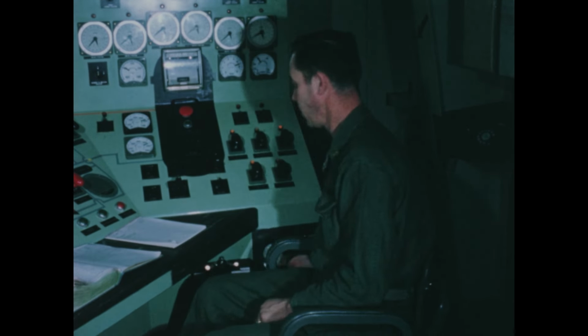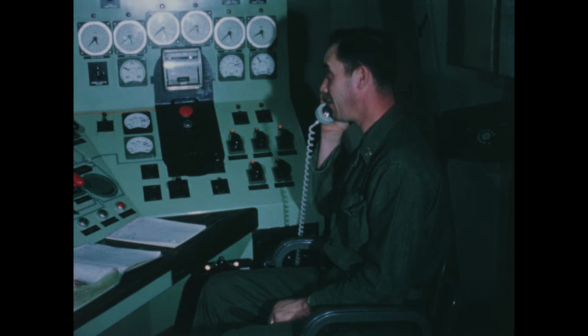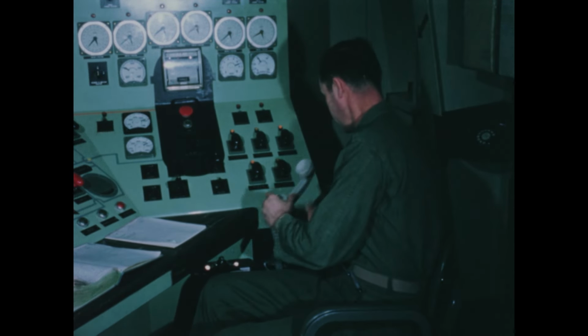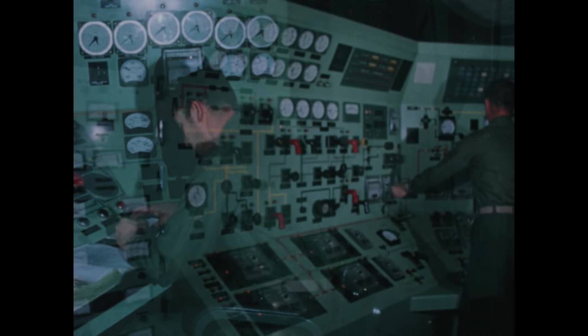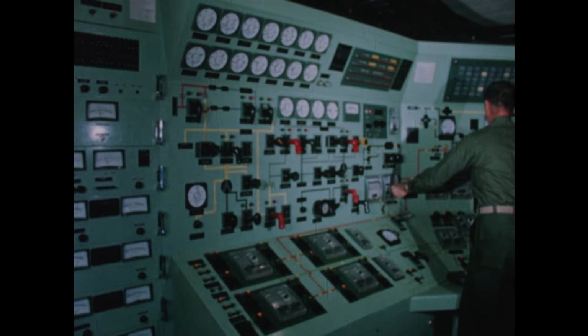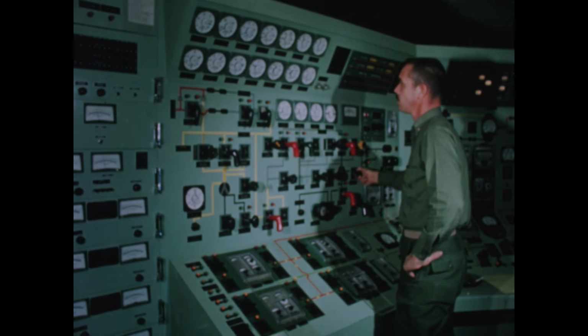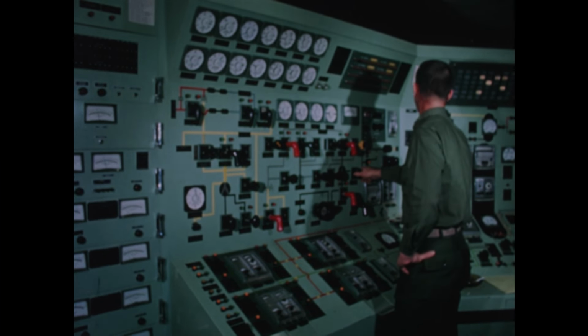After each 2,500 hours of operation, the plant is shut down for testing. When shutting down for this or for any other maintenance, inform the base electric shop so they can start base diesel generators and assume the base load. Reduce the plant load. Start the plant emergency diesel and assume the plant load.